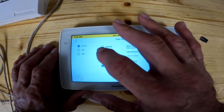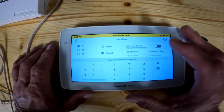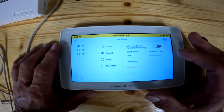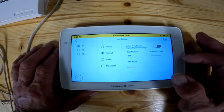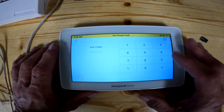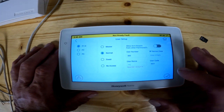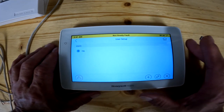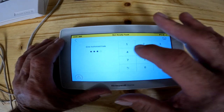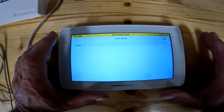For a normal code, you come in here and enter a digit for the user number — starting at user two, then three, four, five, six, and so on. I hit enter, there's no RF button, no key button, so we don't need to put that in there. I'm going to give them a name and a user code. I'm going to make it 4321. When done, I hit the okay button and it's saved. To delete this code, I go up here, hit the X on it, enter the master code. It asks if I'm sure I want to delete — yes. Now that user is gone. I could add more users if I wanted to.